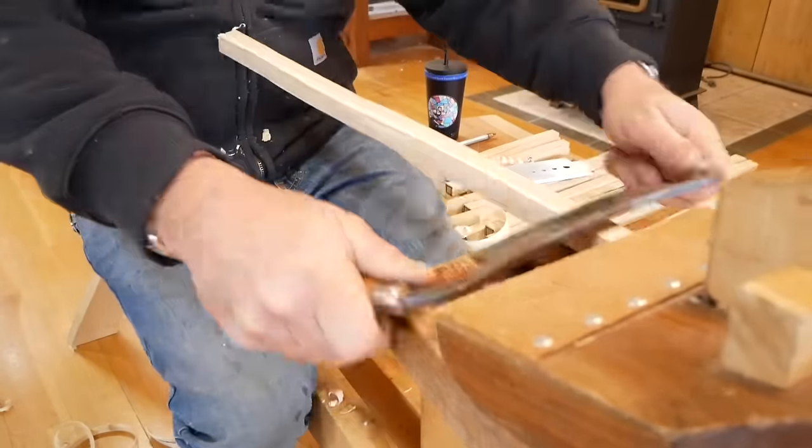That's why Greg mentioned the kiln — we get them down to size. We do a roughing size, go square and then octagon, and start to work them into rounds. Then we put them in the kiln for maybe two days. Patrick is learning the shave horse and draw knife. Rob has a little bit of experience, and I have a little bit of experience. Now we're going from square to octagon — that's eight sides — and slowly start working it. I messed up a few; some of them are bent from weird grain direction. But by the time it's done, you'd be surprised at how beautifully symmetrical they all seem.